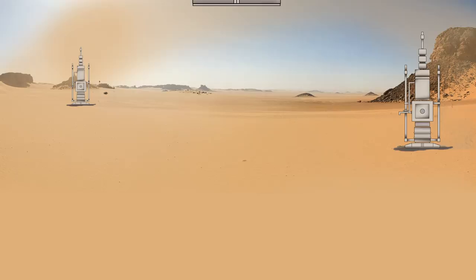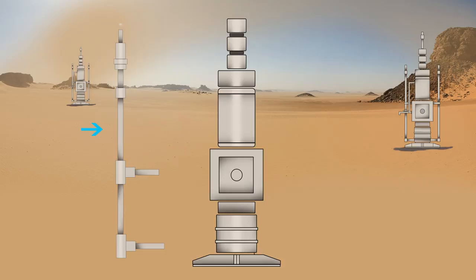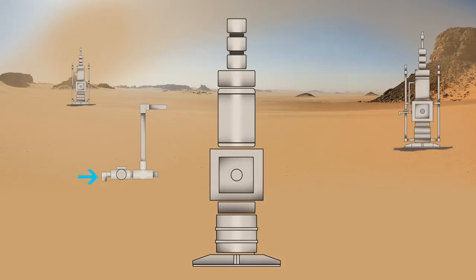We build our struts out of 1 1/4 inch PVC. That combined with the T-joints, and finally an interesting looking reducer. All the exact parts will be listed on our website, see notes in the description below. Next, we'll assemble our valve and return piping. We use the same pipe dimensions, along with a couple of elbows, a valve, and another T-joint.